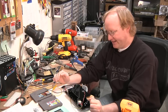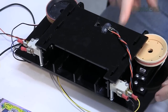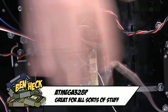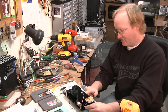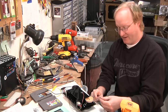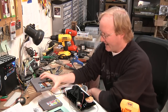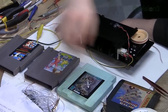After messing around with the IR sensor, I finally got the load-unload mechanism working. I used a 38 kilohertz IR sensor like what's on a VCR or DVD player to sense if the cartridge is in place. I have a microcontroller down there, and it's got its own regulator so the servos won't draw too much power away from the Nintendo. We have two servos, spring-loaded, with a bunch of sensors. Basically, if you block the IR sensor, it detects a cartridge and starts moving the servo wheels. Once both limit switches are hit it stops and changes state to 'loaded'. You can also eject it with the eject button. To test it, I have an old Nintendo cartridge, an unlicensed Color Dreams, and an unlicensed Tengen.